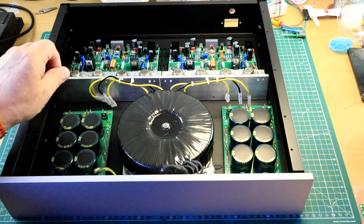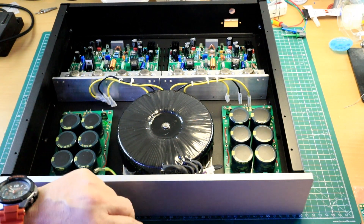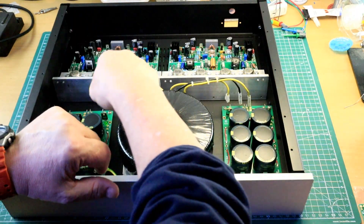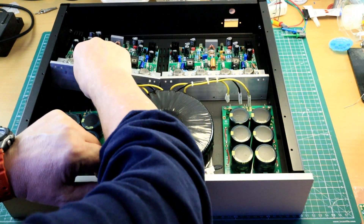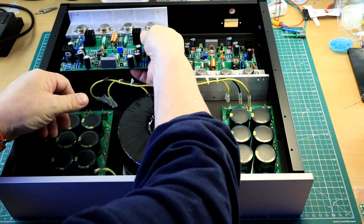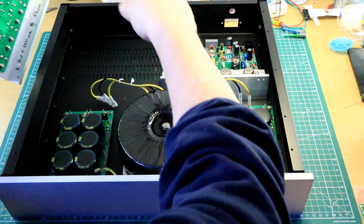This case chassis work is nowhere near man enough to take the heat off these spreaders, so I'm engineering a little adaptation. There is going to be a big aluminium plate fixed to the base of this to spread the load, and then these U-channels — which will become apparent — will be fixed to that big heat sink.